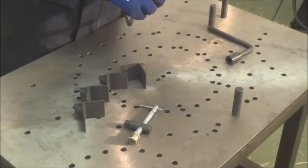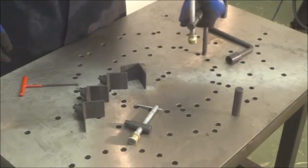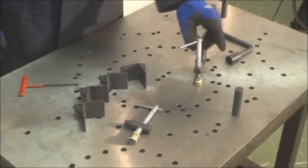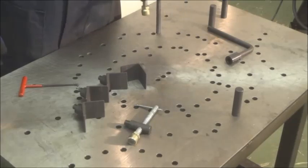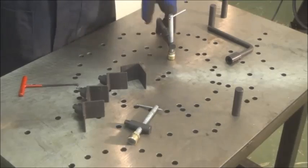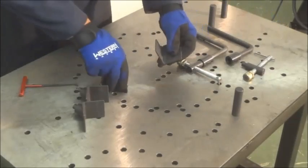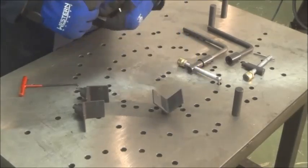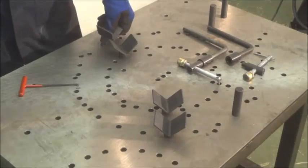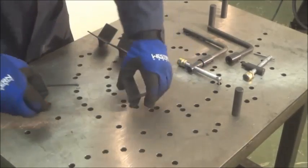By inserting the holder in any hole, you simply drop it down to the part and tighten. Like the V-clamps, it can be removed or swiveled out of the way for part changes. The available V-blocks come as a set of 4. They are used for tubing or shaped bar stock. Place them in any hole to generate any available angle.